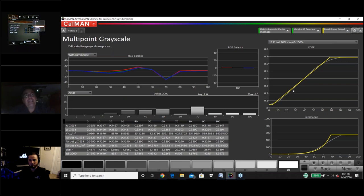So next thing is we can do customs. And this is where Chris Deering came into being with me. And bless your heart, Chris, thank you so much for showing this to me about 3 years ago in Denver. It was awesome. It was actually how to create what's called RV curves or custom gamma curves on the JVC projectors. So you can actually use third-party software to create new gamma curves. So we're going to go ahead and do that now.